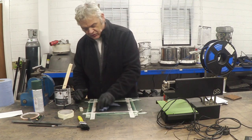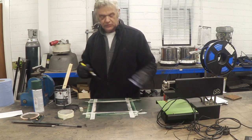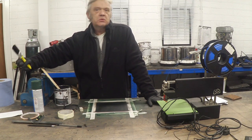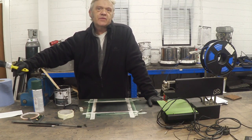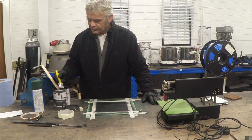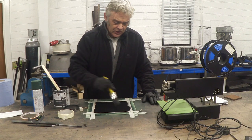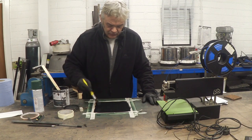As you can see it's quite a nice graphene-graphite colour, and that will make the next layers firmly attached. All we have to do when that's dried is paint a layer of the resistive ink. The thicker the ink, the less resistive it's going to be — so if you're using 24 volts, two coats will be fine; at 12 volts, three coats. If you want to experiment with more coats for very low draw, go ahead, because we're on an aluminium surface which is quite stable. Paint a fairly thick even coat on there.